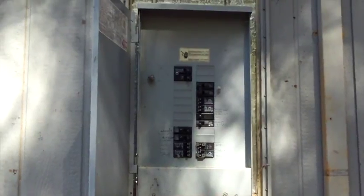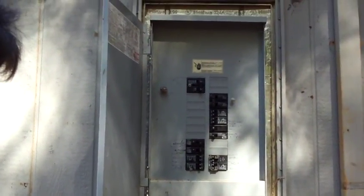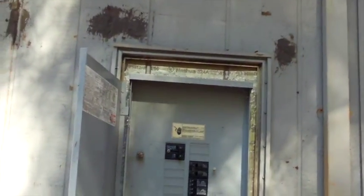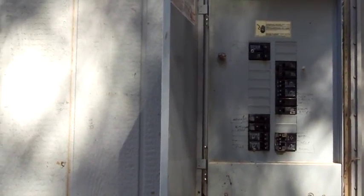Bondo. I was wondering about that too. It looks like they had a roof structure built over the breaker box. Oh, I see what you mean. I can see the outline. Sometimes, if this gets a whole lot of sun, it is possible with older branch circuit wiring for this box to get hot and cause the breakers to pop. But I don't think that would be the case here. This should have copper wiring, which isn't really susceptible to that.